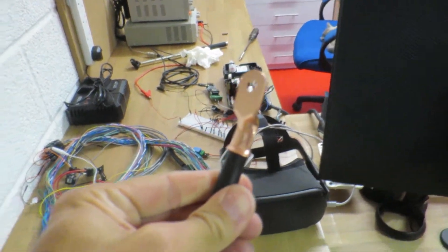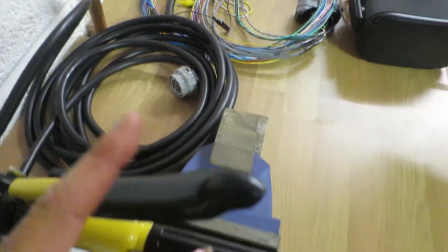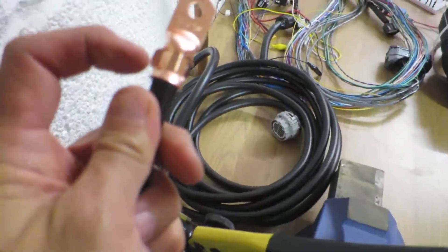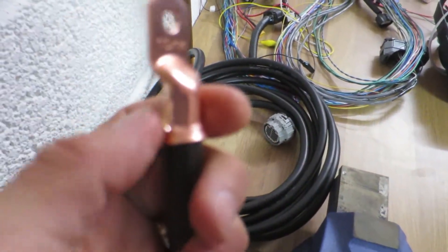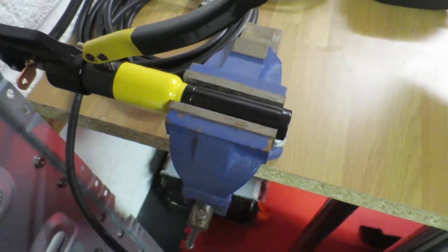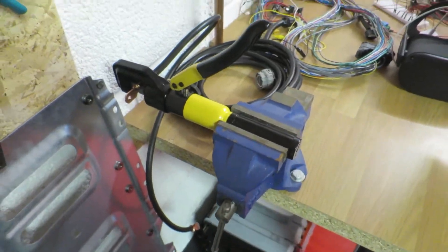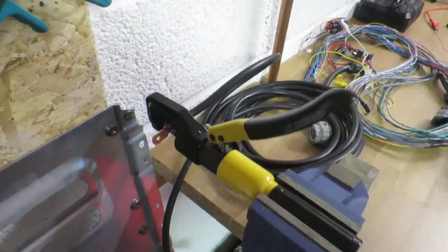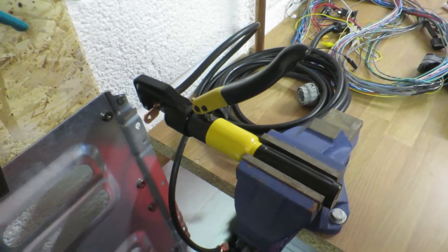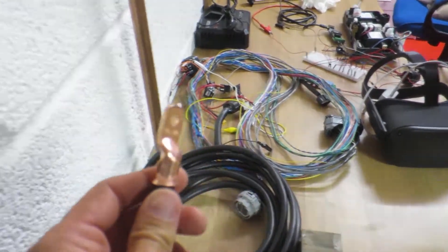Thank you again for all the advice - never too old to learn. I was just playing with this after I turned the video off and I've managed to clamp it down a good couple more notches. You can see how it's really squished out these flanges and compressed the middle like a core. What I did is just put this in the vice very loosely - it hardly holds it, but it just allows me to pump the tool a lot easier with one or two hands. Got a couple of extra pumps in, which gets the dies in here very close but not touching, as the instructions say. I never really felt like I got them very close before, but they are very close now - so that's excellent.